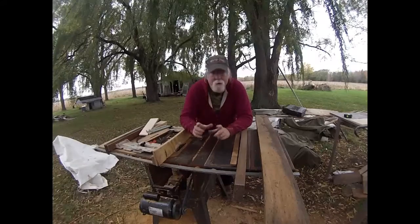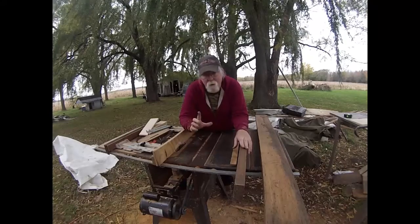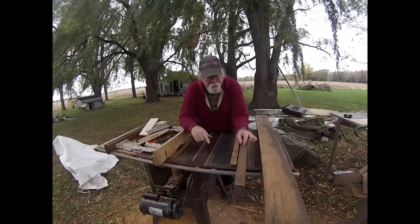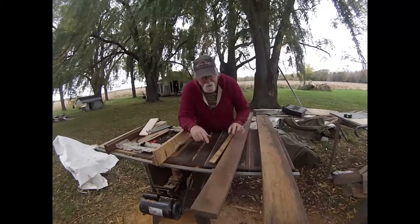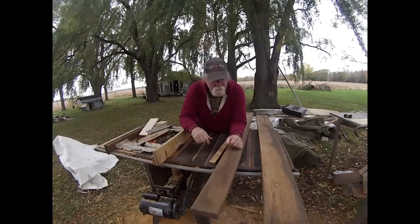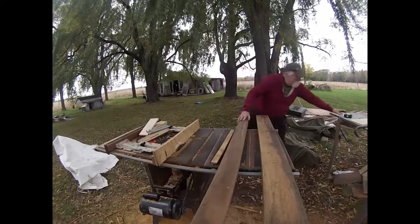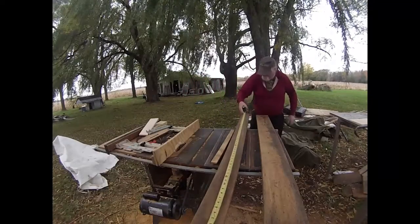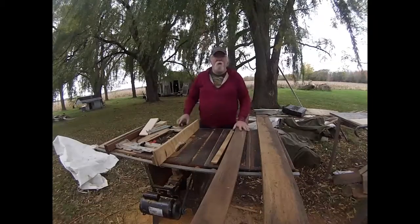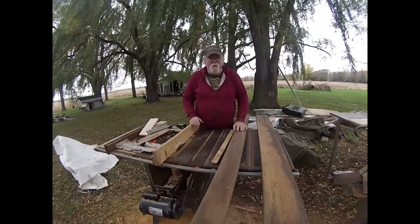Okay, now those are the 1/2 inch C's. I only needed 4 of them. The corner pieces for the 3/4 inch, I'm doing a little bit differently. I'm going to take the full big board and cut a dado out of each side, and then rip it down to size. Those are going to be 6 feet long, and I don't have any that are 6 feet, I don't think. Yeah, it's 5.5 feet. So no problem, I'll make extra, and I'll put the bigger pieces at the top and the smaller pieces at the bottom where they aren't going to be as noticeable.